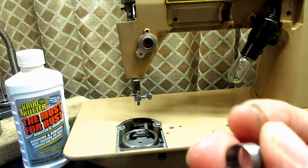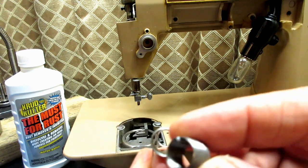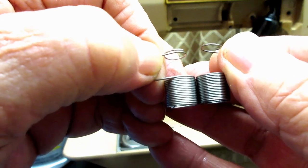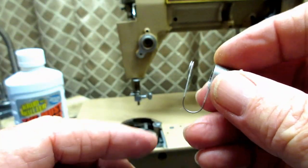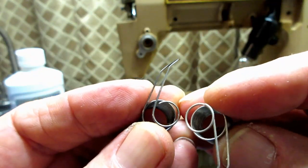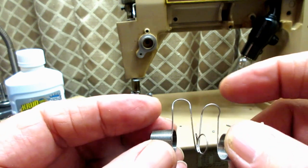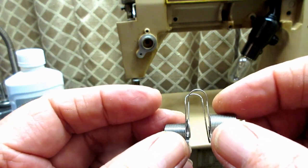So that's a way I look at it when I take it apart — to see if it's the original spring or a replacement. Besides being a little bigger in diameter, the length of the coil is maybe just one turn longer. Also what has bothered me is that the loop and the eyelet loop that goes around the tension stud are a little bit bigger on the new ones. The finger or extended loop that the actual thread checks against is also just a wee bit wider.